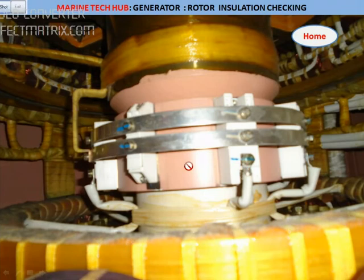So this is very important for the electrical officers. To check the rotor side, you disconnect the line from the excitation side — that is the rotor excitation — you remove all these terminals and check. And for the main rotor, you remove only two terminals because it is a simple coil there.